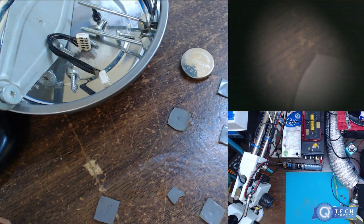Basically, you don't really use the machine only for changing BGA chips. I like to use it for taking off the HDMI ports too. They just come off easy, and then you just vacuum up the pockets.